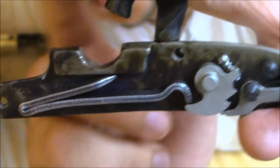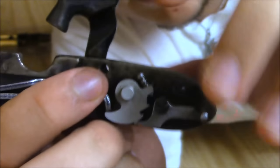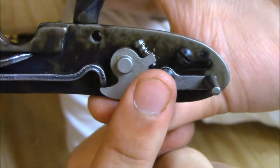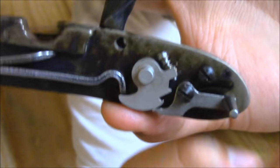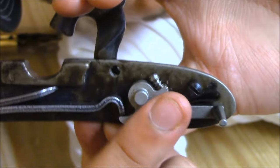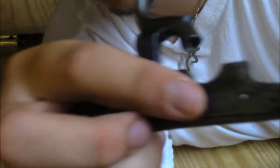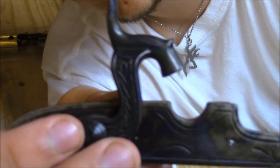To go to full cock, you'd pull it all the way back to where the hammer is right around here, and the trigger will be in this area. You can see there's a slope there, so when this is pushed upwards, it is pushed downwards and then slips out. This tensioning spring then forces this little rotator piece down, which also forces the hammer onto the percussion cap, and the percussion cap explodes, sending a small explosion down toward the barrel.